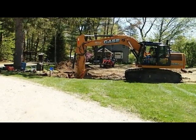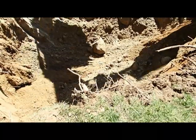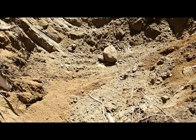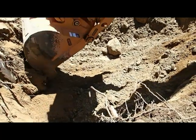We're beginning to get down into wet soil. We're getting a little water yield in the middle of the hole here. It's possible we will hit a vein or two that will yield faster than this ground usually does — this is a very, very tight soil.